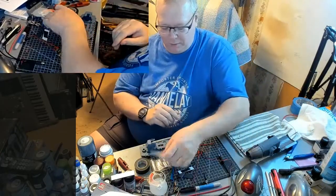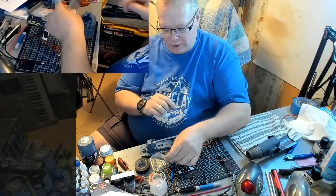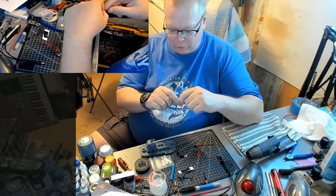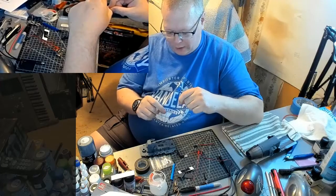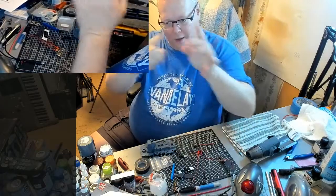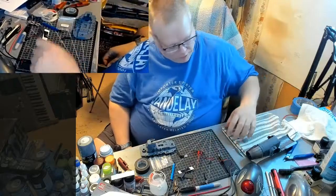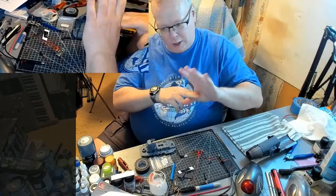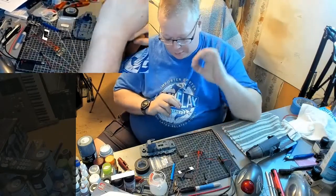Take a red one and a yellow one, and you wire them in series. So that's basically take a wire, put it on the positive one, run it to the negative of the other, and that connects the two together, and then you've got the negative and the positive that are going to go to the power source, and that's how you run them in series. So you do that, put them together, heat shrink them to hold them together like that, and then put them in